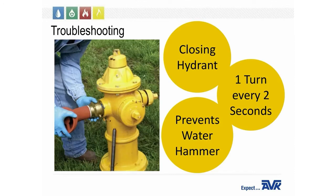Next, install your diffuser and open the hydrant. Make sure you fully open the hydrant — this ensures everything in the bonnet stays lubricated and easy to operate. Then, while shutting down the hydrant, we recommend one turn every two seconds to prevent water hammers. Also keep in mind, the weep holes are designed to allow flow for the first seven turns. Meaning, if you flow your hydrant partially open, there's a chance water will fill up the drain field and start to bubble up around the lower barrel.